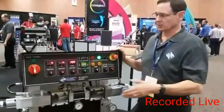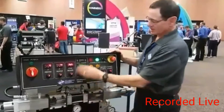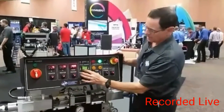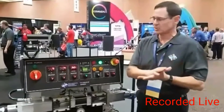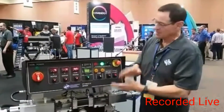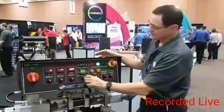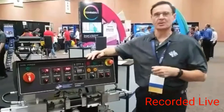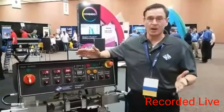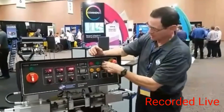It will take 2400 cycles for this machine to exhaust a 55-gallon barrel set. So what you'll do is go and enter that value into here. When you hit that 2400 cycle count, the machine will shut itself down. Both of these features can be bypassed if you don't want to use them — you can simply turn them off and continue to run the machine. In some cases people don't want them on, and in most cases people do, especially the pressure balance control.